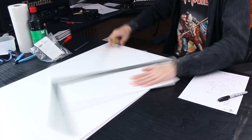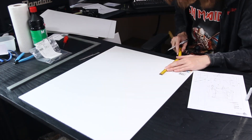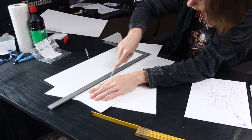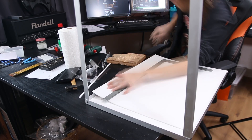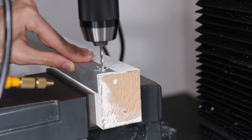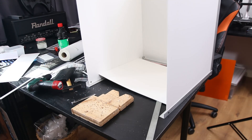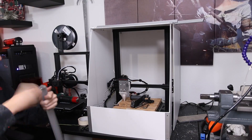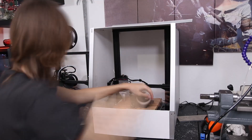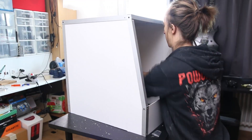I used very cheap plastic sheets used for arts and crafts or sign making. They're fairly cheap and they don't really burn — they just melt if you get them hot but won't catch fire like wood would. To connect everything I used aluminum extrusion corner brackets that I drilled through and used screws to hold it all together. I also made it so the enclosure is attached to the top of the printer but not touching the bottom, so the printer sits on vibration dampeners and the enclosure doesn't transfer vibrations to the table either. This way I could keep the enclosure small while still having it isolated from the table.